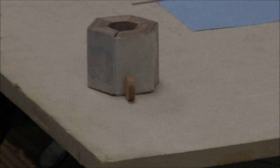On some saw blades, the teeth stick out more. It's more of a hook. That's more aggressive; it's going to pull the wood in faster. On the radial arm saw or the chop saw, you want less of that. The teeth are not out here.